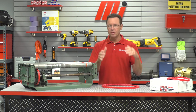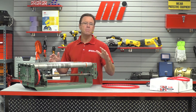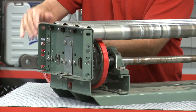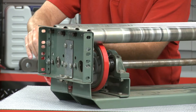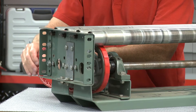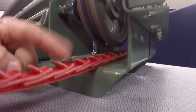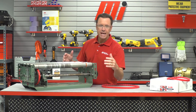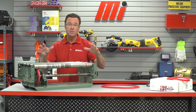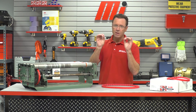First we need to determine the direction of drive rotation — it's either going to be clockwise or counterclockwise. The belt needs to be installed with the tabs trailing. For this particular one, this is the way the conveyor is going to be rolling — the wheels are going to be rolling in a clockwise mechanism. You can see that the tabs are actually trailing. Once we roll it on, we adjust the tension with an adjustment mechanism to finish the job and make it nice and tight.